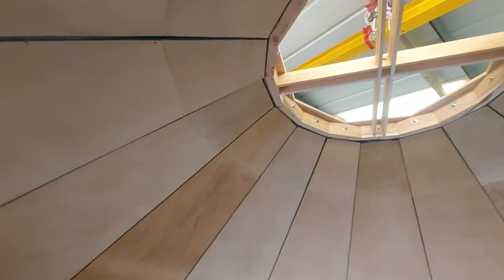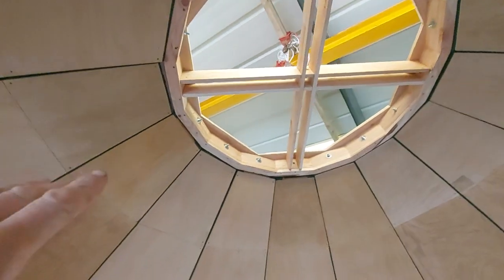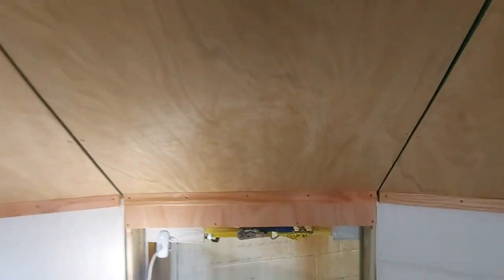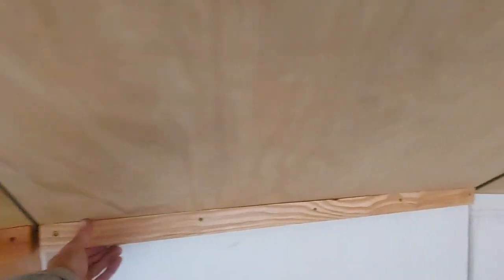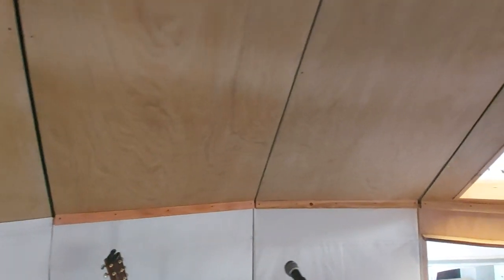When you put this up, there's a scaffold inside, and the panels individually locate with a bolt up in the roof, which allows a tiny bit of movement to even out any discrepancies. The band here is the retaining strip that stops the roof from sliding off the walls — in conventional roofing that would be a bird's mouth or gob cut. There are four that still need to go in once it's been tuned a little bit more.